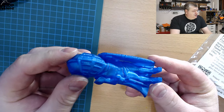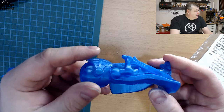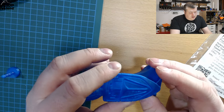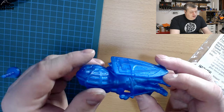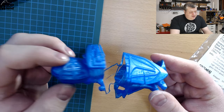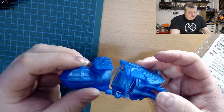Then I printed a series piece and had quite a lot of cracking — you can see all the cracking issues on the edges. The print finished without any other flaws, but we started to notice the cracking as the print went on. It didn't fall off, but as you can see it's very brittle and layer adhesion is not very good. Maybe I should have had more heat in the enclosure to prevent this.